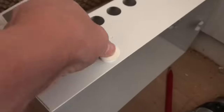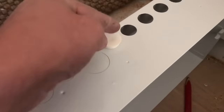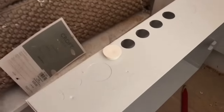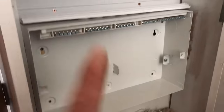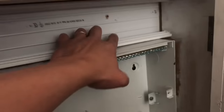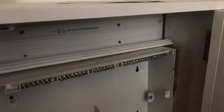So I've just cone cut the holes out. These are the grommets — they're like a whisker flame retardant grommet. You just knock that in there, there's a little slice and you can drop your cables in there. Snugly wugly. Now we've got our board fixed in, there's all our grommets — just cut out nicely in there. Now I've just got to drill a hole through here, bring all my cables through and then bring them to the fuse board.